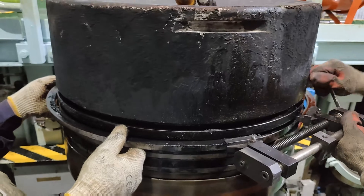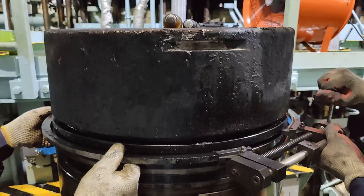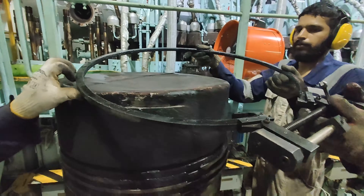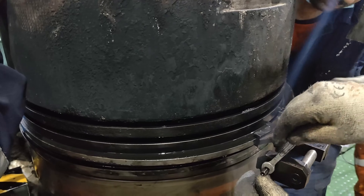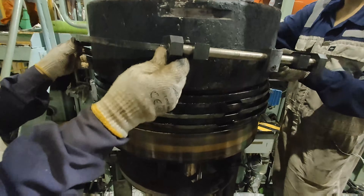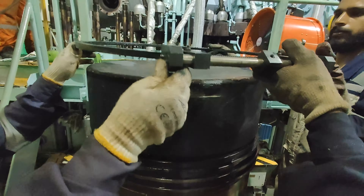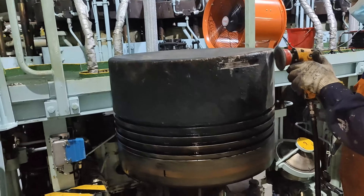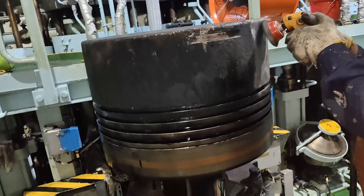To proceed, take off the second, third, and fourth piston ring by means of the ring expander. If your engine is equipped with two ring expanders, the short ring expander is for the uppermost ring. After removing the piston rings, carefully clean the piston of all carbon deposits.